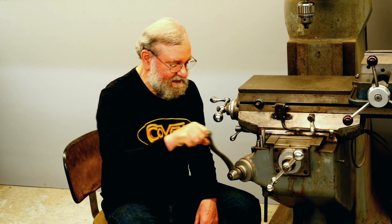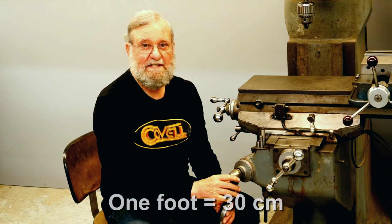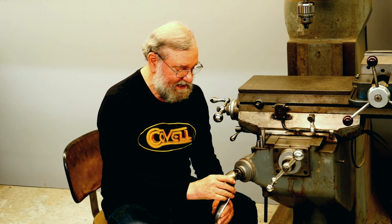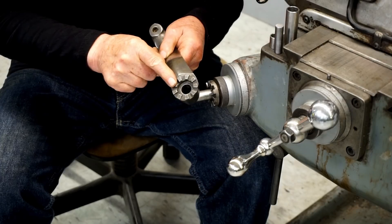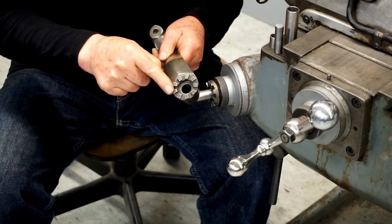The knee is the hardest part to move, and it sometimes needs to move up or down a foot for different size workpieces. Powering the knee is more challenging, since the handle uses a 9-dog engagement. A good machinist could make a 9-pin collar, but it's not a trivial job.